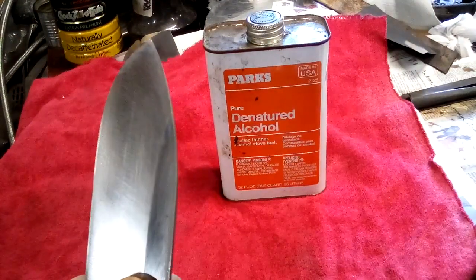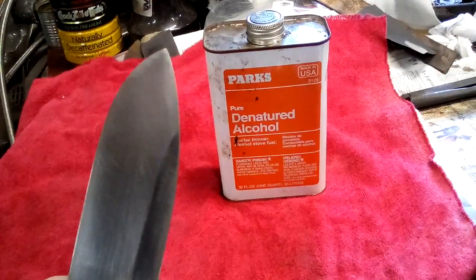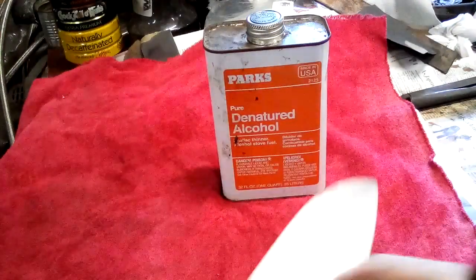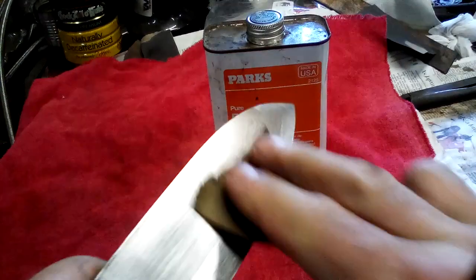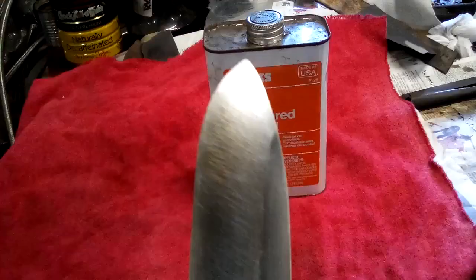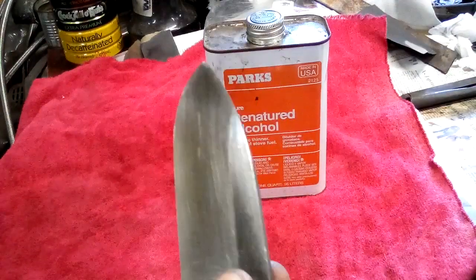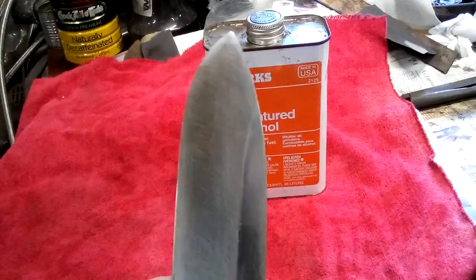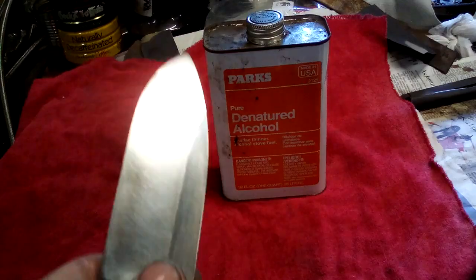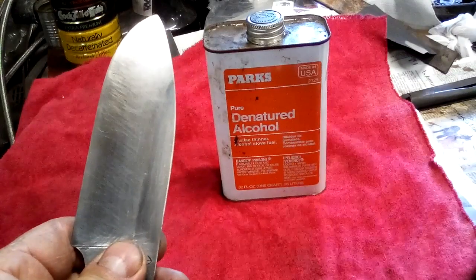Here is the knife blade after hardening and tempering. I've lightly gone over it with some 240 grit carbide paper, because what you want is a clean, slightly fuzzy surface. You can make a swirly motion and you end up with a wire-brushed kind of appearance — satiny. You don't want it to be polished; it needs to have a little bit of surface to it, a little tooth. Once you've got it to this point, take some denatured alcohol and degrease it so that your grimy fingerprints won't show up in the finish.